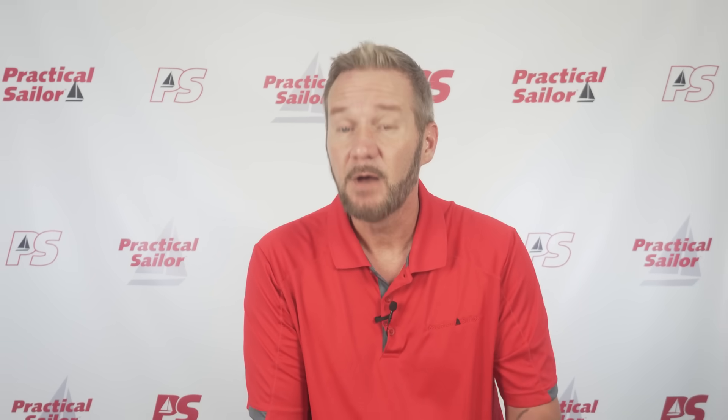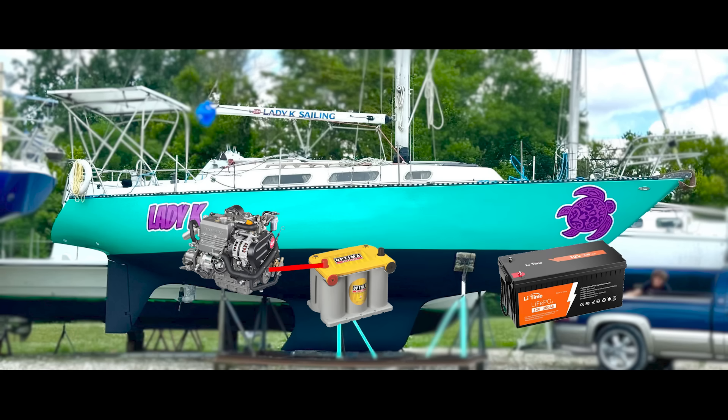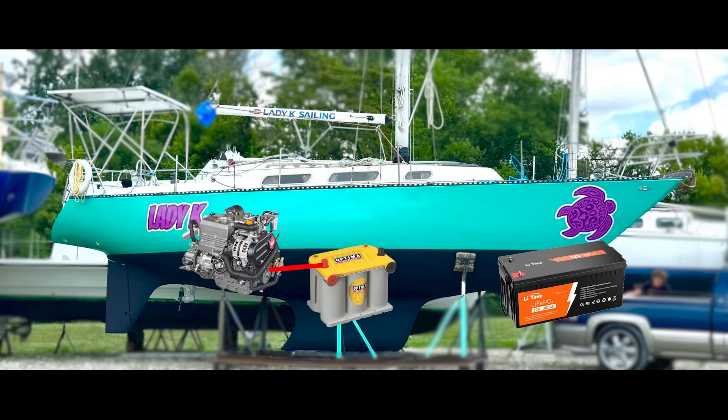It's time to replace the house bank. The last system I built was lithium, and I used Li-Time 300-amp-hour units that cost about a thousand bucks each. These worked really well, and I have really good experience with this brand. Lithium is good for about 80% discharge, so while we got 225 usable amp-hours for $1,000 with the golf carts, now our $1,000 gets us 240 usable 12-volt amp-hours. The single 300-amp-hour lithium unit is smaller and lighter than the four golf cart batteries — way lighter. But with the engine no longer hooked up to the house bank, we still want the alternator to provide a charge. Since we can't hook it to lithium, we add a DC-to-DC charger between the battery banks. When it sees that the engine battery is full and above 13.2 volts — meaning the engine's running — it starts using it to charge the house bank. When you shut off the engine, it stops. If we use all of our 240 available amp-hours in this lithium battery, our 550 watts of solar will fully recharge them in about five hours of direct sunlight, which is conveniently exactly what we get every day.